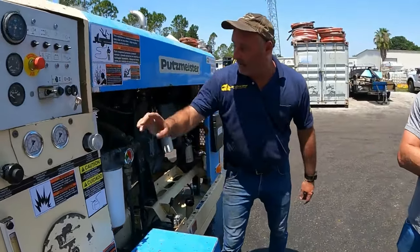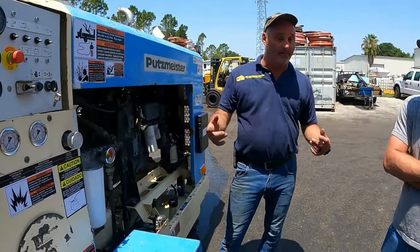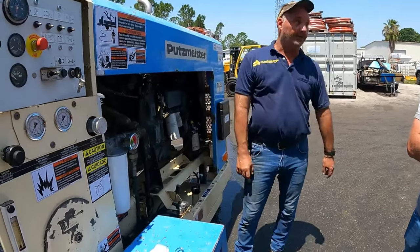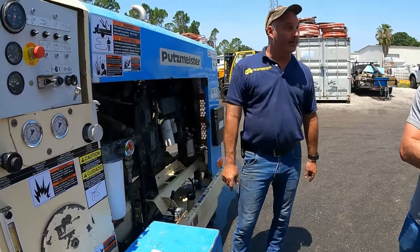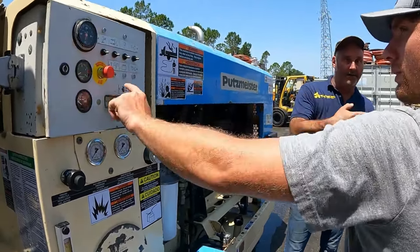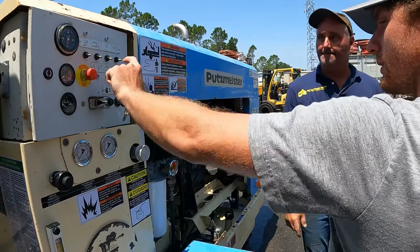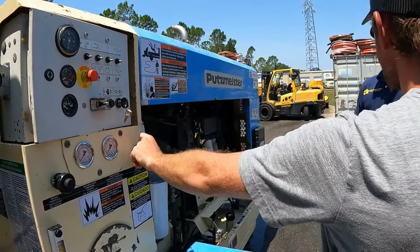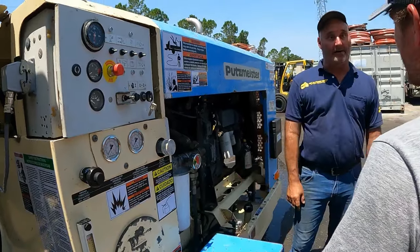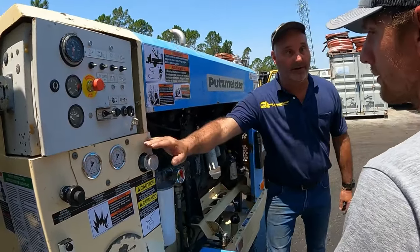And percentage-wise, you're telling the regulator on the pump what to demand. So that line is running this little whip line, the feed line, at working pressure, about 20 bar. And it tells the regulator to push on the swash plate. You said this controls this? No, that tells the pump to come online, but it doesn't know what percentage to come on to. This is what tells it.